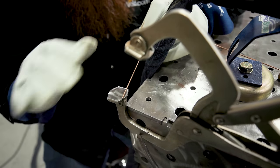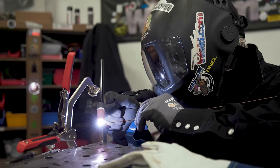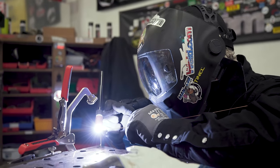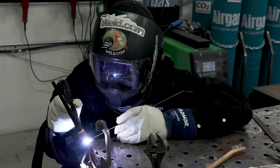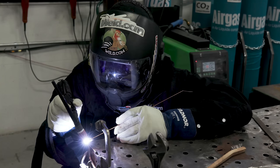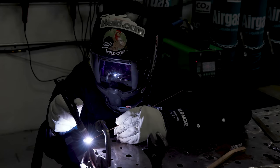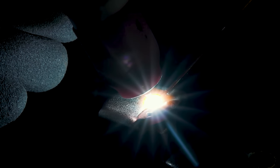I'm just going to run little passes in there and build that surface up, then clean it all back down to one uniform surface. I'm not going to wait to establish a puddle — I just want to stack this material on top of that plate. We're not welding, so I don't want to melt the base material. I'm just trying to build up the surface with silicon bronze, running little passes side by side with good overlap. You don't want any really low spots — all the high spots will get knocked down.